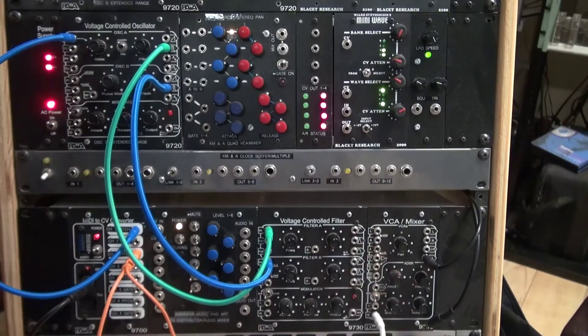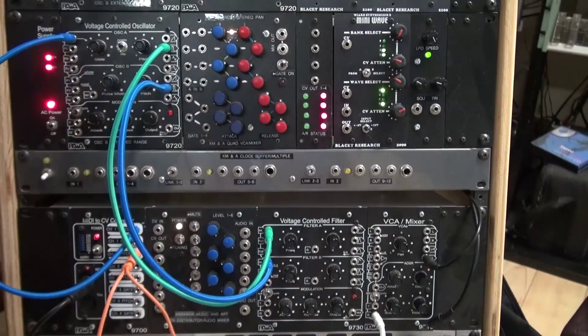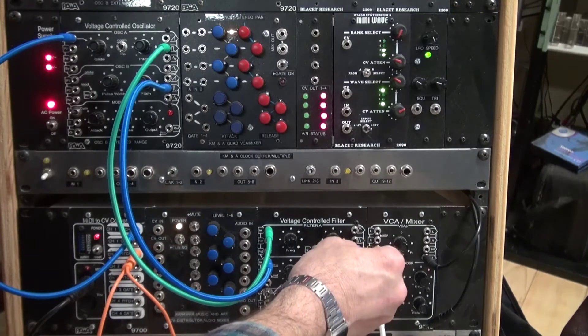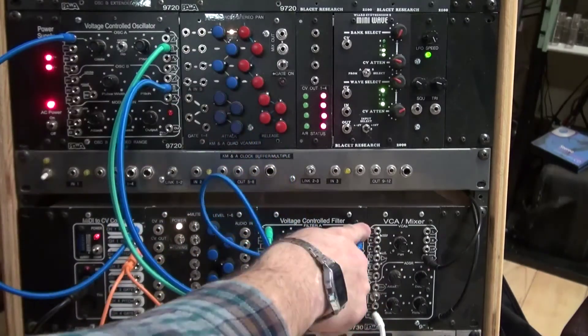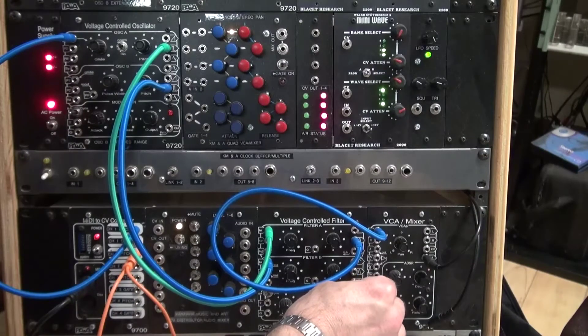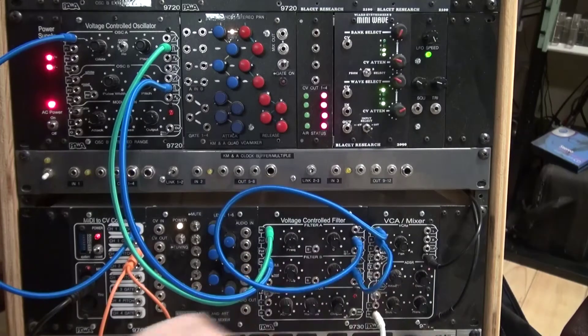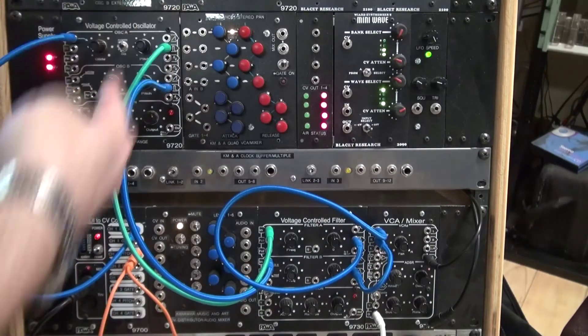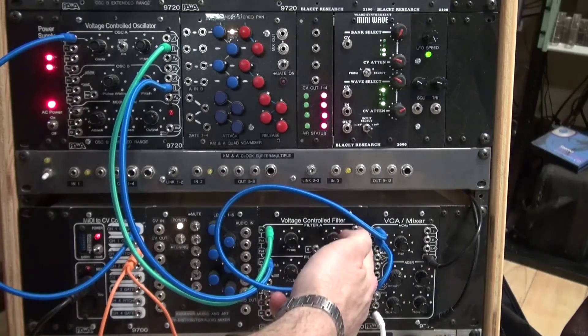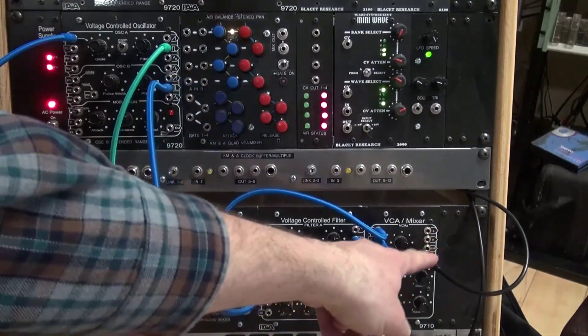The outputs of the filters are high pass, band pass, and low pass — times two, it's just duplicated. I'm not sure what it is with my setup, it almost seems like something is wrong. I've done so much messing with this system, maybe I did something to it, but the low pass doesn't seem to be working right. So in this case I'm just going to take band pass and put it in left — but you can put it in left or right. Same thing here, into the right. Left and right going from the two filters. So we have a pitch control going in, two oscillators coming out to the filters, two filters going out to left and right, and then the output to your amplifier or whatever you're using to listen is the A output over here.